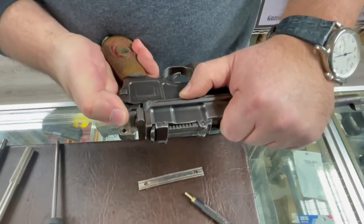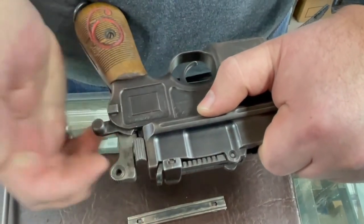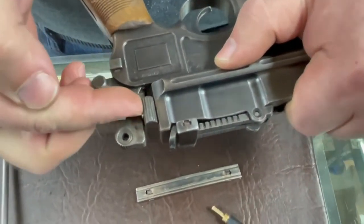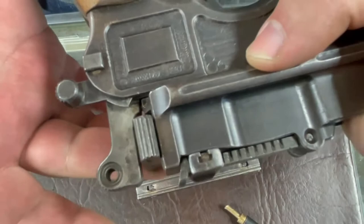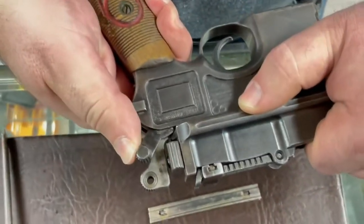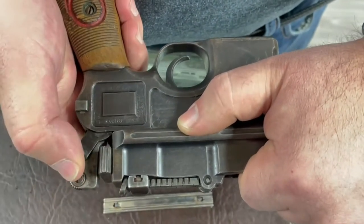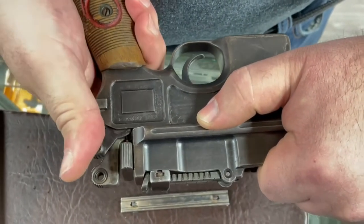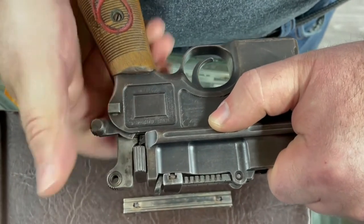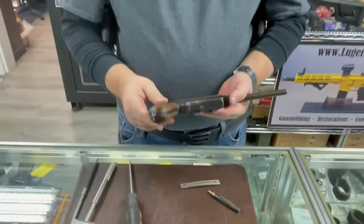Ease the hammer off. You'll see the hammer puts itself back into position on the firing pin — now there is no gap. It should push it back just slightly, creating that gap. If your safety doesn't do that, you have a potential problem that needs to be addressed. I think this concludes our testing and safety precautions for reviewing the pistol before firing.